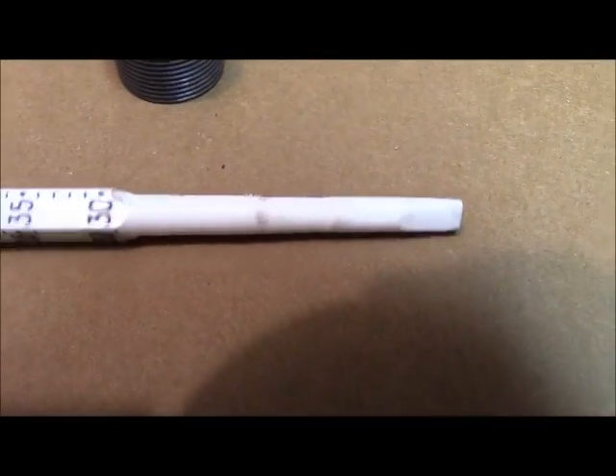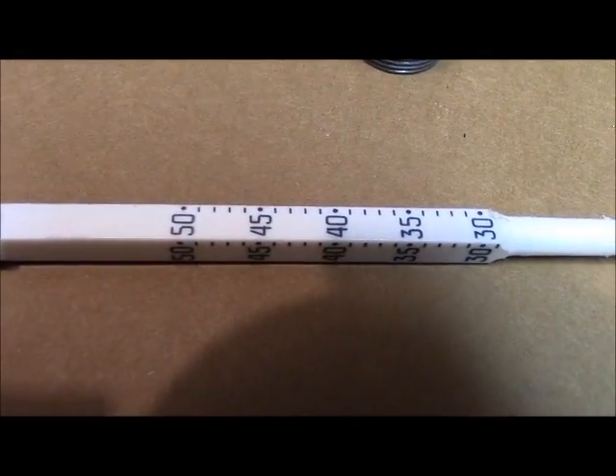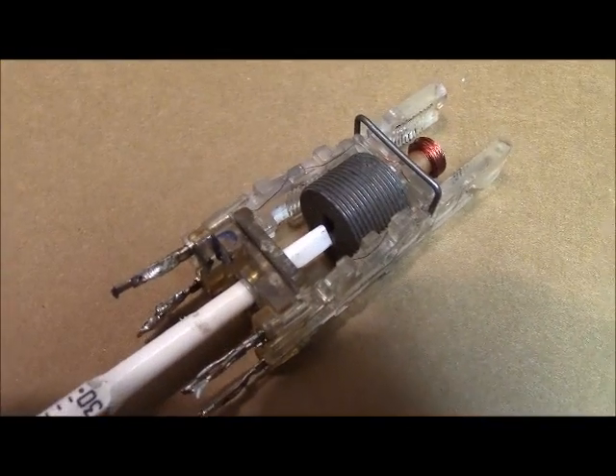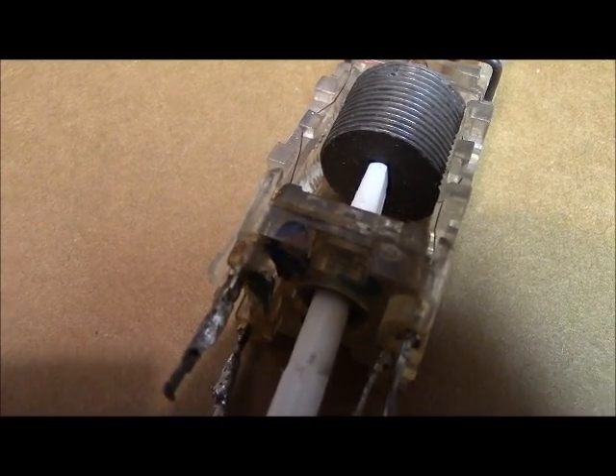This adjustment tool — I ground it round on the end and then ground the shape on the bench grinder. And what this is — you probably recognize it — it's the plastic piece out of a tire gauge. It works just perfect. But it has to slip down into the hole of the IF, go down into the slug, and be able to turn it. It's going to fit that hole just right. If the shank is any bigger it's not going to go into that ferrule there.